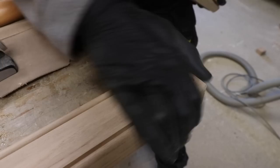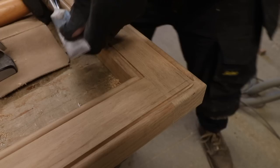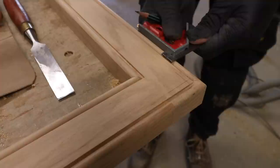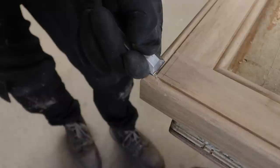Get a nice corner on that. Beautiful. That's the easy bit done. They want to be like it anyway, normally, but especially for something like this, your chisels, you want to be able to have a good clean shave with your chisels so that you get really clean, sharp cuts and you cut in the wood fibres. Not sort of, what's the word I'm looking for, bruising them or denting them, you're actually cleanly cutting them. Grains of wood at just that individual grain level, rather than trying to just force it to come out of the timber.